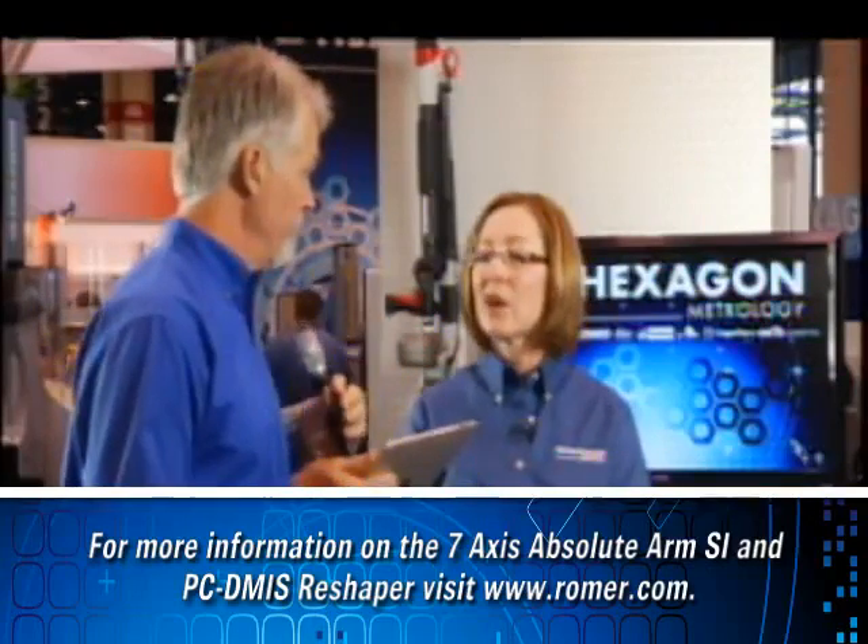The last question: how often do you need to calibrate the scanner? Not very often, if at all. Since the scanner is integrated with the arm, it's fully calibrated at the factory. We also provide a certified artifact with the scanner so the user can check whether it's measuring within spec before starting measurements. If it's not, it's a very quick two-minute process to recalibrate.